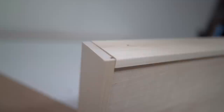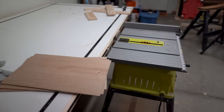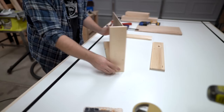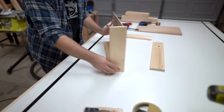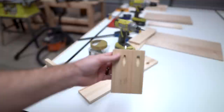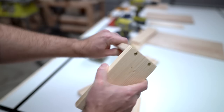I run all these through and use my bench as an outfeed table — first time I've used it for that and I really liked it. The drawer bottoms were just a little too wide, so I had to adjust my fence just a hair and run them all through again, and they ended up fitting perfectly. Time for the assembly portion — this is really just like Legos. After you make this groove, everything should fit together really well, especially if you use that scrap piece technique. The slots should be pretty tight but you shouldn't have to do too much work. I did a test using pocket holes — this is typically what you would use to make drawers — but I pulled them straight apart, so I ended up testing butt joints instead, and they were super strong.